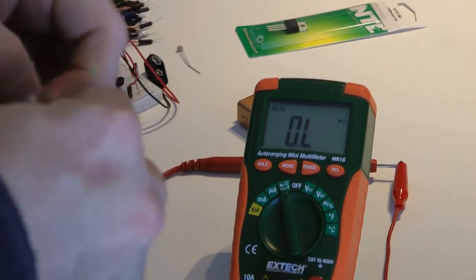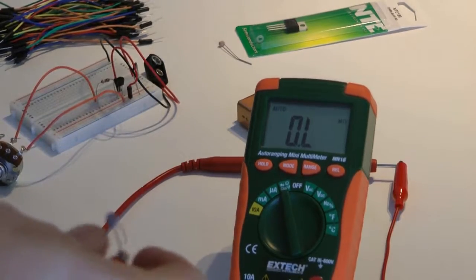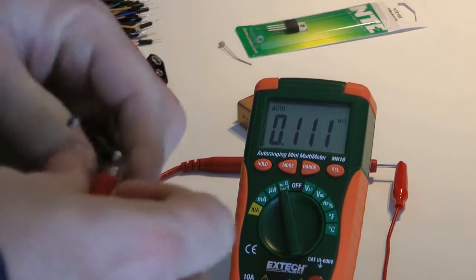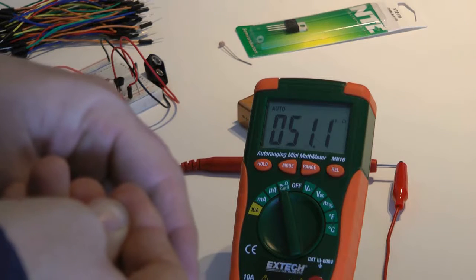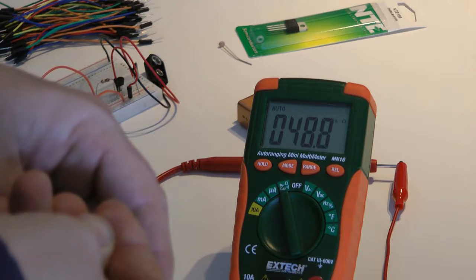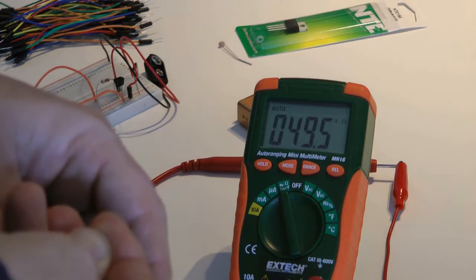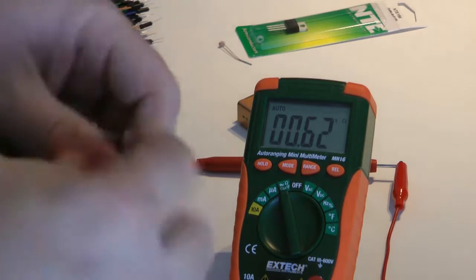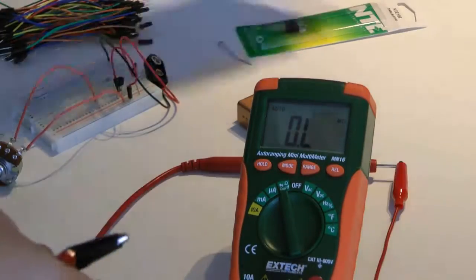And we got one more to try, actually two more to try here. I think this one is identical to the last one we tried. So we'll just put him on and put him in the dark. Nope, and although he looked identical, in the dark he's only 49,000 ohms. So he looked identical. Can't judge an LDR by its cover.